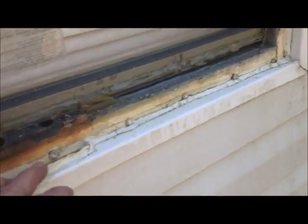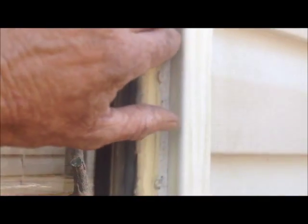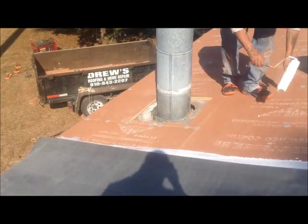Looking at these windows, they're eventually going to have to be replaced. Somebody tacked these windows in — I don't know what was here before, maybe air conditioning — and water is just going behind them, leaking everywhere. That's terrible. It needs real new-construction windows. Get rid of the J channel here and have a J channel incorporated into the window, then put your metal siding into that — that would be the way to go. But that's where we are with this place, and I think it's going to come out really nice.